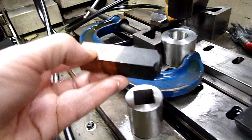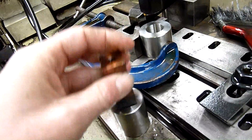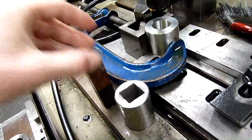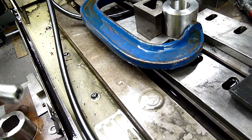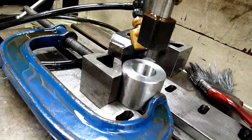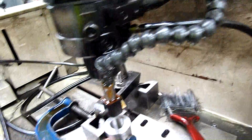The tank can obviously be opened up for working on it. That's an example of an electrode — and that's electrode wear. Basically they're adapting electric motors — nothing silly, nothing important. That's the main drain. That's fluid level, tank level — higher fluid level, lower fluid level. That one there is suction through the spindle — there's a hole through the spindle back to here, so it can actually suck fluid up and keep flushing that way. And there's main oil flushing.